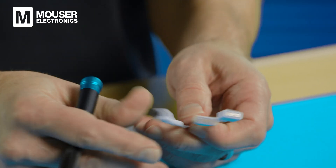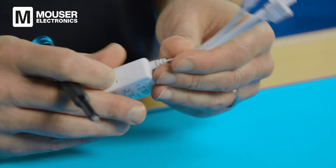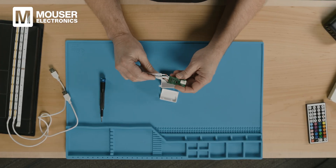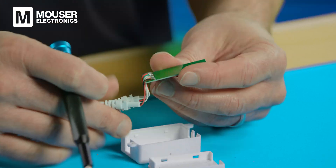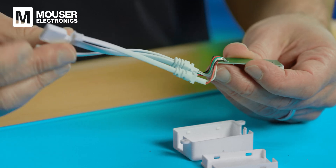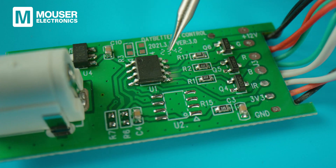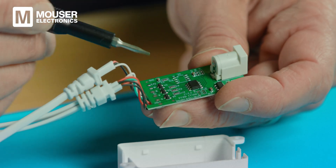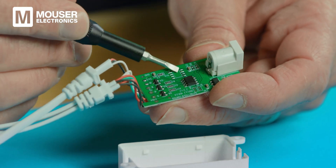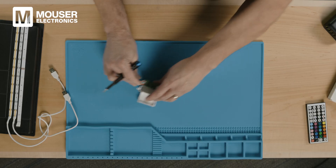Taking the controller on the end, we have the IR sensor — the little sensor at the end — and of course the plugs. Opening this up, we can see the PCB inside. There's a barrel connector for power on the end, and on the back side the wires are soldered to go to the three different cables: one for the IR sensor and two that connect to the LED strips. On the top of the PCB is the controller IC in the middle. There are no markings to identify it. Interestingly, there's also an unpopulated footprint for another IC — possibly used in a different design variant.